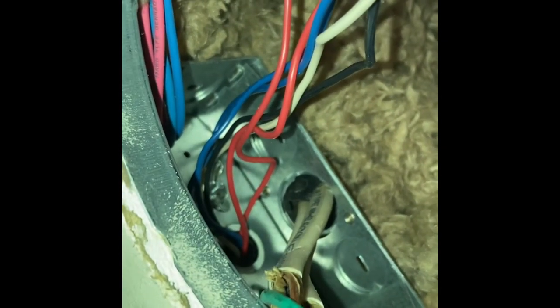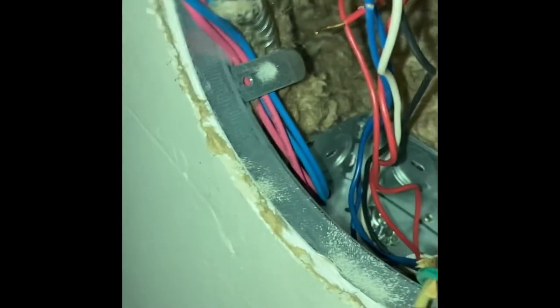Remember what I said too, don't disconnect anything with the ground, just keep that together. I didn't even need to take the cap off of that one, I'll put it right back on. Okay, so you won't need to mess with that. That mess of wiring coming out right there in the middle, all these small little stranded wires, is from your original ballast. So we are gonna cut all those off. We don't need those anymore. We're not running a ballast, we're running it straight to the house. LEDs don't have ballasts.